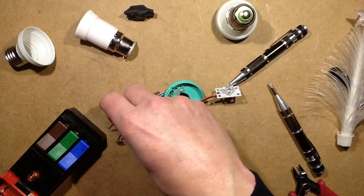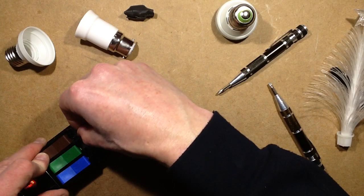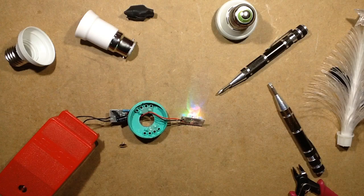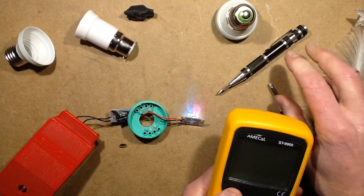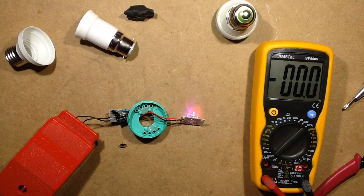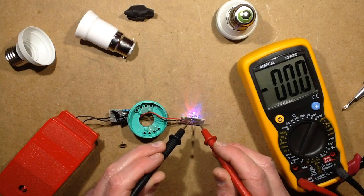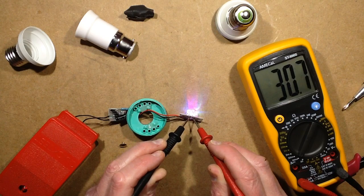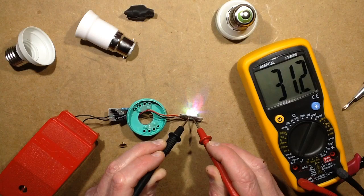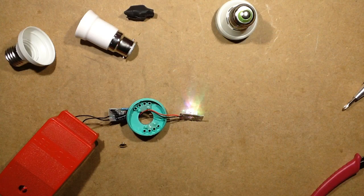I don't know how much it's going to affect the fiber optic display — I don't know if it's going to be as bright because it's not directed onto the end. So I'm just going to stuff this wire in here and this wire in here. That's now lit — I'm going to get a meter. Let's put this to 200mA just in case. It's DC. And I'm going to carefully bridge across here without zapping myself. It's running them pretty hard — it's running about 30mA. That's quite ferocious, but then again there are multiple chips in each. That's really running them quite hard.